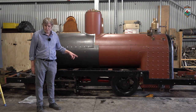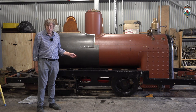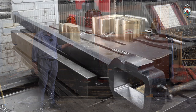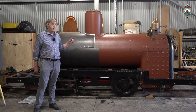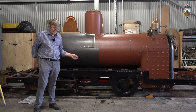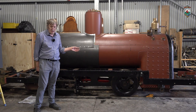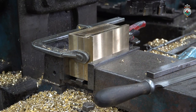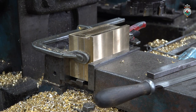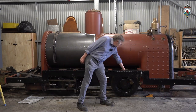At the moment there's no coupling rod or connecting rod on the loco because we're making new ones — they're in the machine shop at the moment. The rods themselves have been fabricated and heat treated and are now in machining, which is a fairly big job but mostly through now. The other parts that go with them are the brasses — those are the ends that sit in the rods and actually form the bearings around the crank pins.